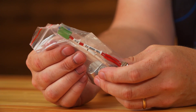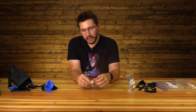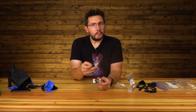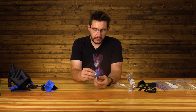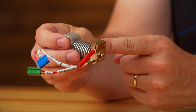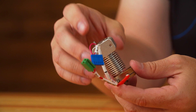This is the high temperature extruder for PEEK, Ultem, and PEI. So if you want to print these high-temperature engineering-grade materials, you do need to switch over to the high-temp extruder. It also has a PEEK liner. Now — how can it have a PEEK liner if it can print PEEK? It's because the PEEK liner stays on the cold side, within the heat sink, going only close to where the heat break intersects with the heat sink. So it's never exposed to temperatures that could melt it. This will go to 450 degrees C — like close to a thousand Fahrenheit. It's the temperature of the sun.